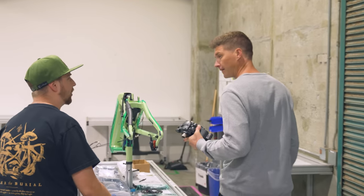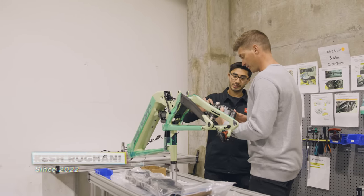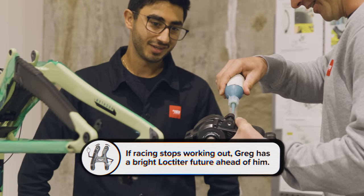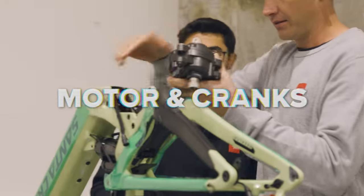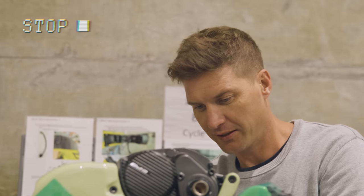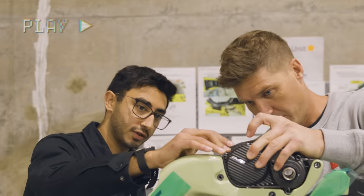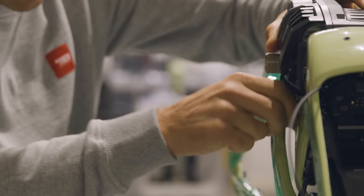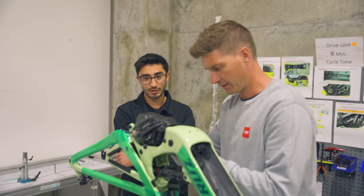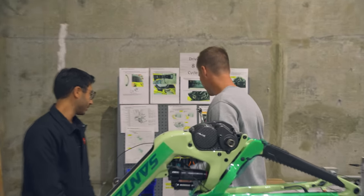The next step is we're going to be installing the motor. I've got Keshe over here — Keshe Money — he's going to help install it. First we're going to loctite all six spots for our motor bolts. I strained my butt off trying to plug these things in and out — just get one of these. Now we've bolted it in, we're going to tri-thread them. How important is the torque? Very important. You're going to be your own mechanic — a finely tuned e-bike mechanic. So that motor goes in.